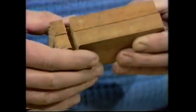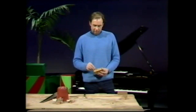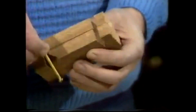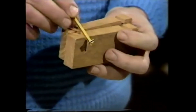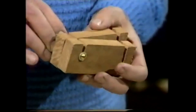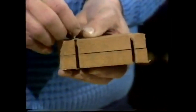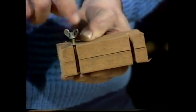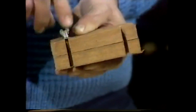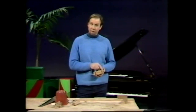That slot works so well, I'm going to get on with this one. If you just use a bolt like that, the danger is it can pull through the wood, so you want to spread the load — you do that with washers. Get a washer that fits, shove it over the bolt, then pull that through the slot. Make sure the two pieces of wood are lined up beautifully. Then at the top, put another load-spreading washer. You can use a nut, but that requires a spanner, so the best thing is to go to the hardware store and get a wing nut — you can do that with your thumb and finger. That one only cost me six cents. They're not expensive. And you'll need one at the other end too.